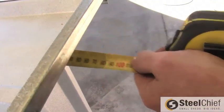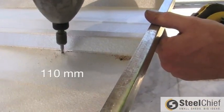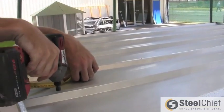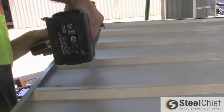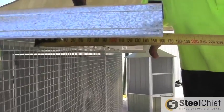To fasten down the roof, measure the distance from the edge of the roof to the face of the wall and add 10mm to ensure screws are positioned in the centre of the wall below. Drill next to the rib, having two screws per sheet. Continue to check that the roof overhang is consistent for each screw you drill in. Repeat this process for the front of the shed roof.